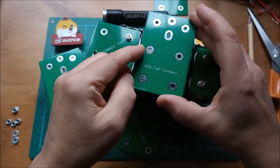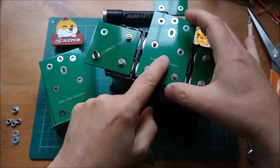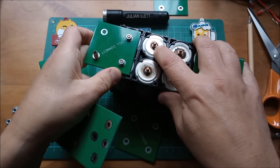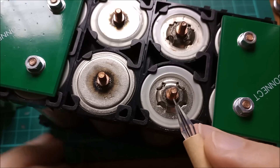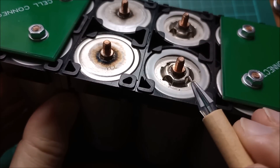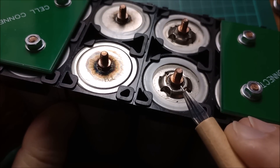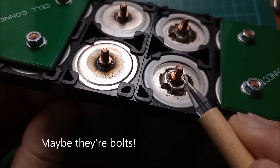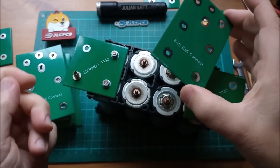I've also slightly reduced the hole diameter to 4.5 mm, so they're a better fit. It makes sense because there's a little flat on these studs — the stud is copper or possibly brass, clearly welded onto the metal, and it has a flat on top that's vaguely hexagonal. I don't know quite why you'd need that, but yes, it's M4 — four millimeter diameter clearance — and it fits really well.